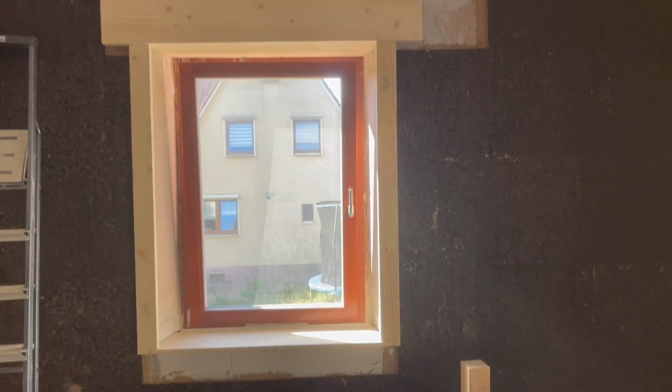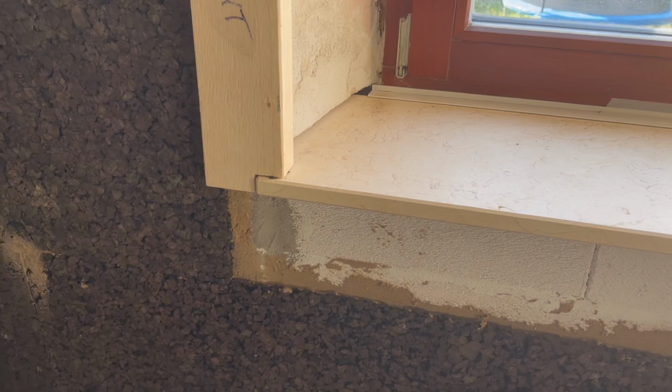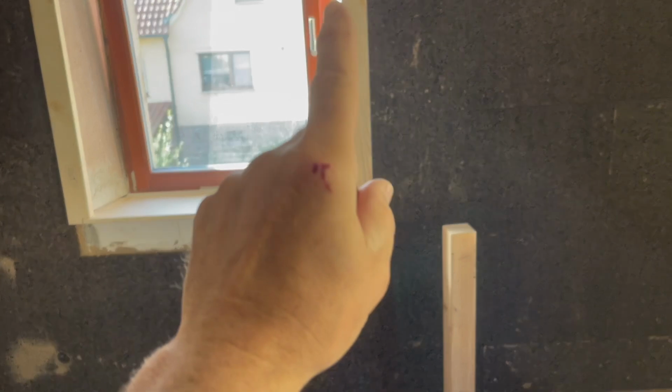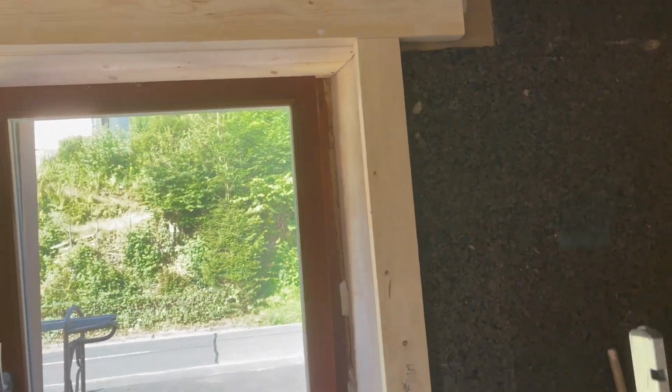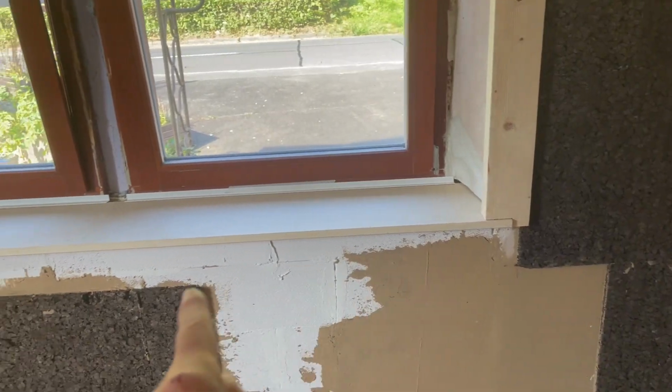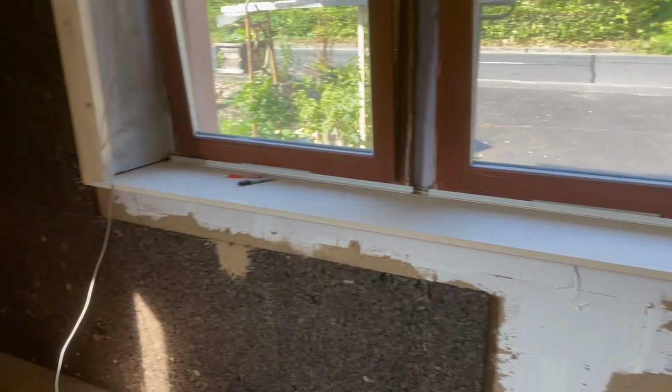All right, so I've got the vertical pieces put in. I've notched around the window seat, and now I need to cut the bottom piece to length, machine the overlap, make sure that that's correct, and then permanently install all 3 of these pieces on both windows. So everything is fitting nicely. The boards are plumb with the beam at the top, and so now I'm just cutting length for the bottoms, and then we'll be ready to install.